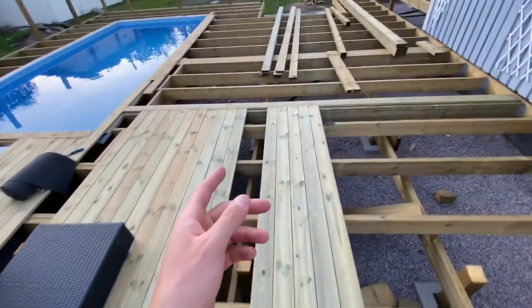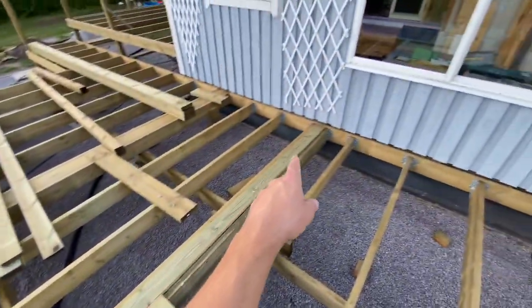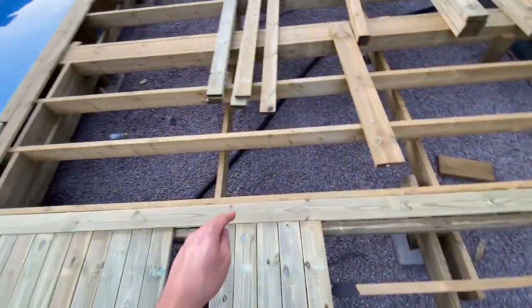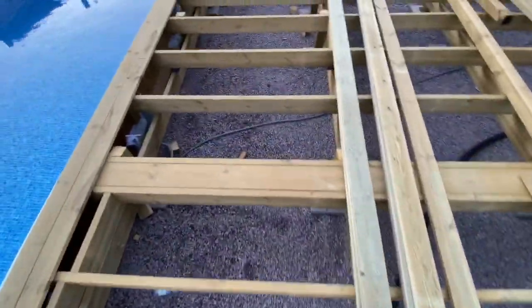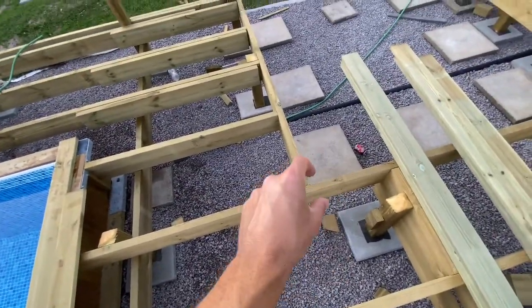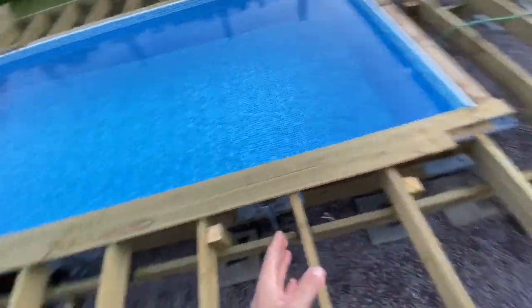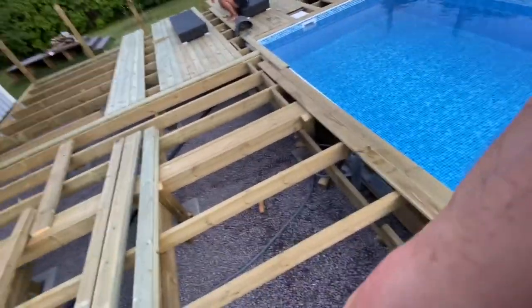Because the deck is so long, I've split it into three sections. I've got the first section, then a divider board that goes that way on its own little section, and then there'll be another section which goes along here up to the edge where the jacuzzi is going to be. Then there'll be a board that runs that way around the jacuzzi, so it'll look quite natural that it splits there and there.